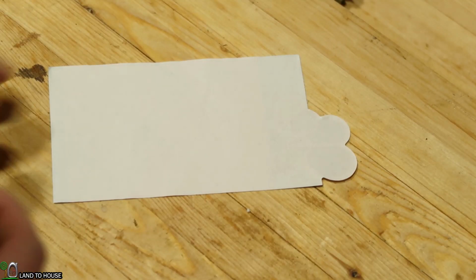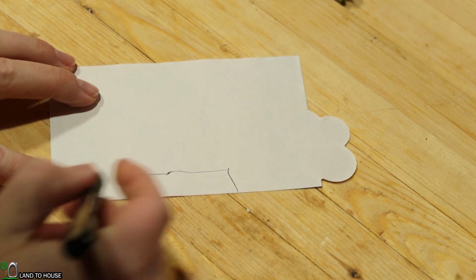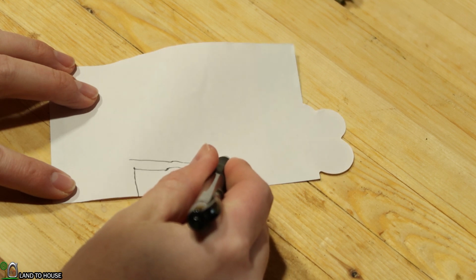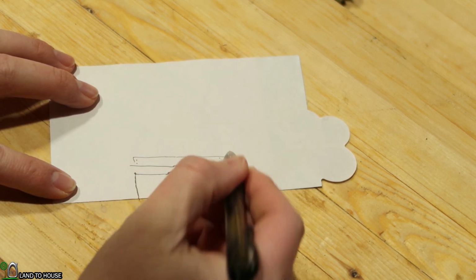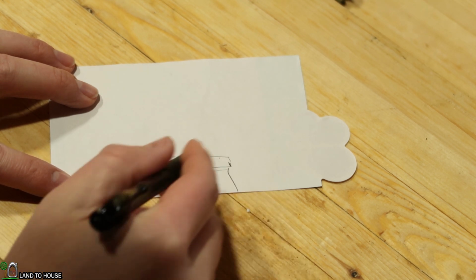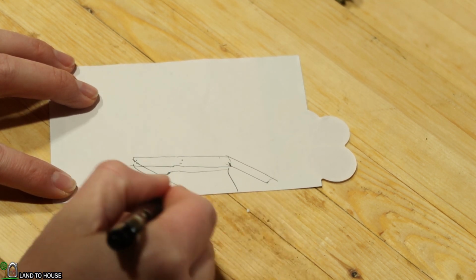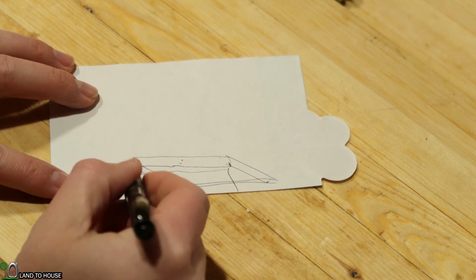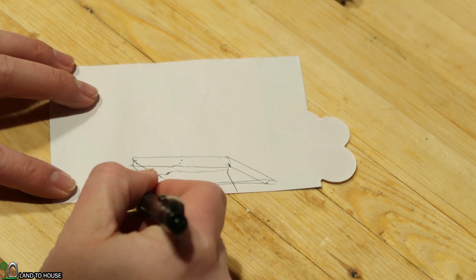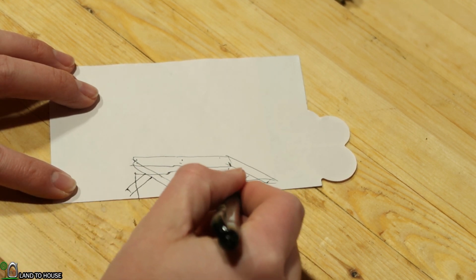Okay, check this out. Here's the plan. The door frame is right here. I'm going to mount a board on top of that. I should have enough for 6 screws in there. From this, I'm going to build a box out, kind of like that. And it's going to have a front board there. And then I'll be able to have these triangular pieces come down to support the box.